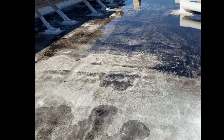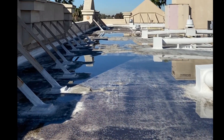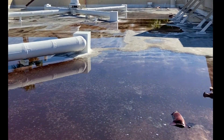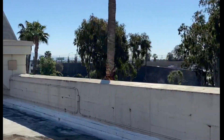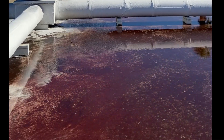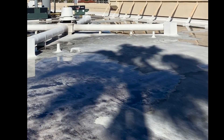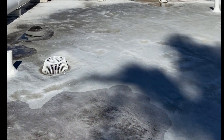This water is going to be here for at least a couple more days. On occasion, sometimes you have a roof that was constructed with poor drainage, and so when it rains you have ponds — and this one is one of the worst ones that I've seen. The discoloration is simply the effects of being right next to a major freeway in Southern California, so this is all just exhaust, but it actually wipes right off. These guys come out and they do broom this as part of their maintenance. I'll walk you over to a drain area over here — you can see that's basically the highest point on the roof, and right now that drain is like the only dry area.